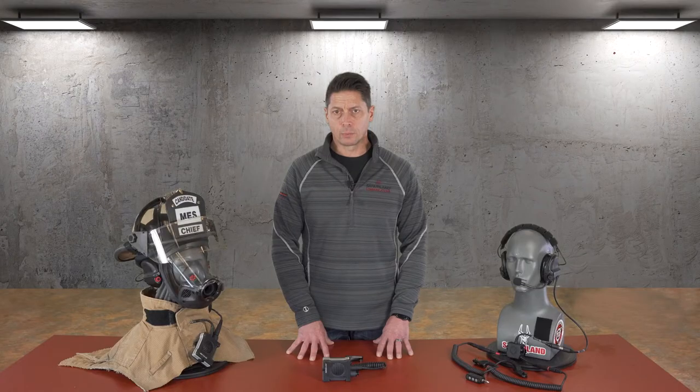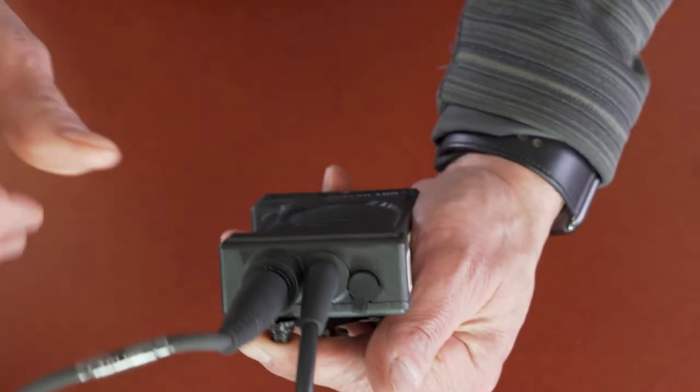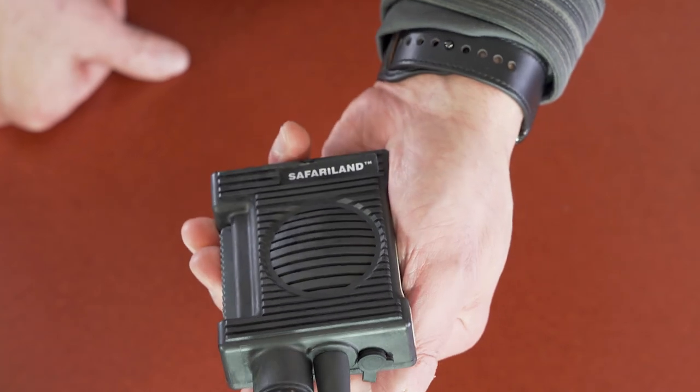The easiest way to extend the service life of your communications equipment is by minimizing physical stressors when possible. Equally important is conducting necessary cleaning and performing routine inspection, identifying early signs of wear which can lead to malfunction. Even though the Redline FSM is tested for the environmental exposure of structural firefighting operations, we recommend the radio be worn in a sling holster under the bunker jacket, with the head of the FSM exposed through the jacket collar and clipped onto a mic tab.